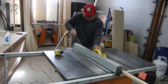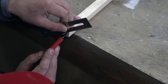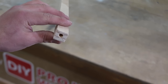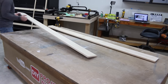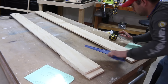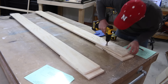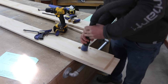The next step was to make the leg support rail. I ripped a pine board on a table saw down to three-quarter inch by three-quarter inch in size, then found the center and drilled a one-and-a-half inch deep hole in each end using a quarter-inch bit. This rail will later connect each leg. Lay the side rails on the table so the outside is facing up and the rounded corners are toward the center. Measure in nine inches from the other end of the rail and four inches up from the bottom, then drill a one-inch hole through the entire board. This is where the female pivot hardware will be placed.